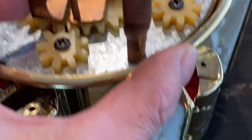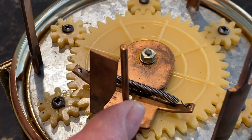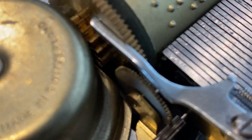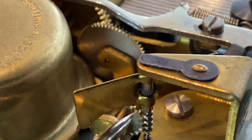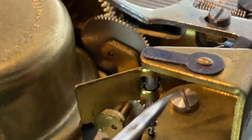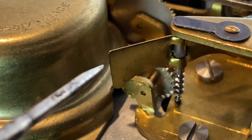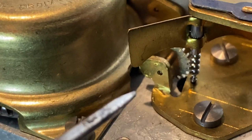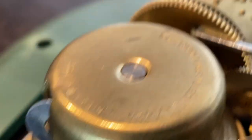On the far end of the barrel we have a lever that is going to go around, and that would in this case move all these gears — these smaller gears and the lower gears — which in turn open and close the doors on this cigarette holder, which is upside down right now because I have it apart. There's another series of springs and gears; the gears lead over to this vertical threaded shaft. That little gear there is going to rotate and turn that shaft. On top of that shaft there are two fins — that's the governor feature, or an air brake — and the resistance on it will keep it steady as it rotates. There are openings in the spring housing to lubricate the spring.